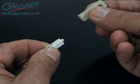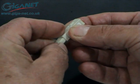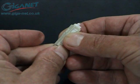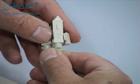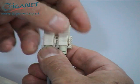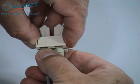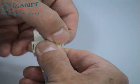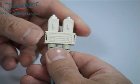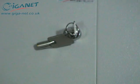If satisfied with the result, fit the connector into its casing. If a duplex connector is being used, repeat the termination process on the second fiber, then fit the duplexing clip to the two completed connectors. Replace the protective caps on the ferrule tips and keep them there until the connector is used.